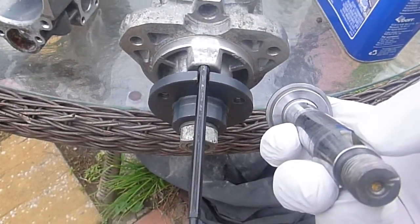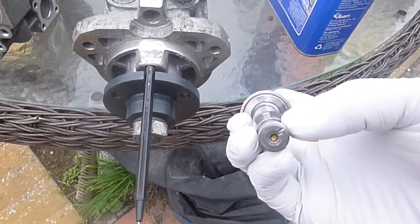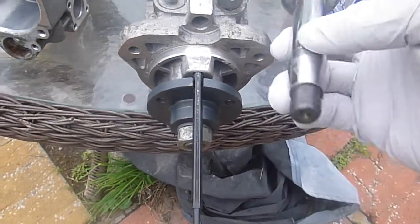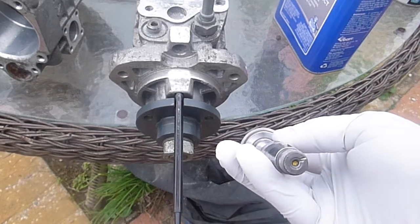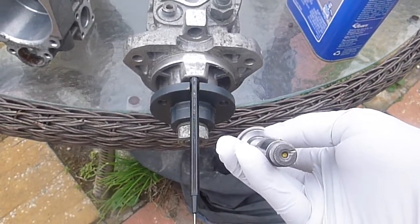If you can see here, it's not where the key is. I thought the keyway is top dead center. If you look on the end here, you see that's the keyway, and there's the mark for where the top dead center or the lock is on the pump. It looks like it's off about 80 degrees.